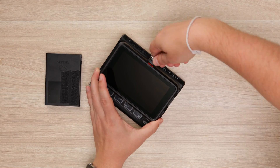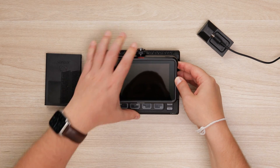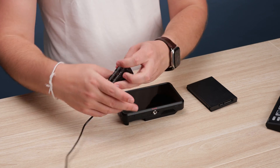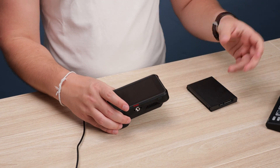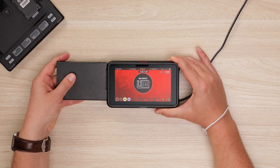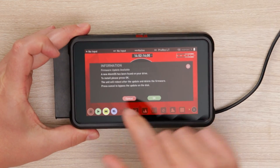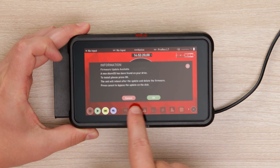Now that you have everything ready, I would disconnect the Atomos from any accessories that it might be connected to, like for example the Atom X cast. Then you take the power adapter, plug that into a constant power source, and plug that into the Atomos Ninja. You can then directly slot the media into the Atomos recorder. If you do that with the device already turned on, the operating system will actually directly ask you if you want to install the firmware on that drive. You can just choose yes and go ahead with that step.